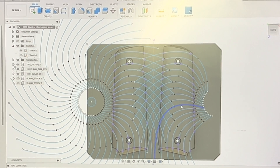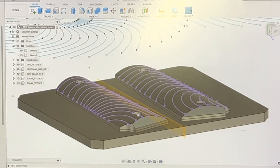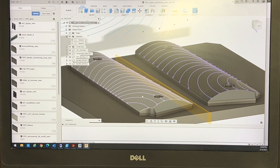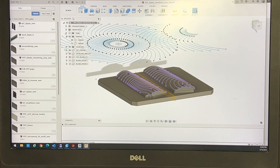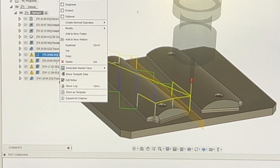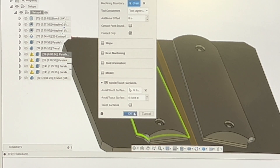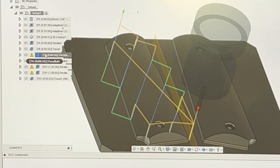Within this same sketch, we're going to go ahead and project to surface — you only need to select the curves that you want. There are lots of videos online showing you exactly how to do this; this is just documenting what I did. Now all that's left is to go back into the CAM, select trace pattern, select those curves, and give it whatever depth you want. In my case, my axial offset was 10 thou and I ran two depths of pass.